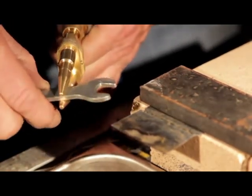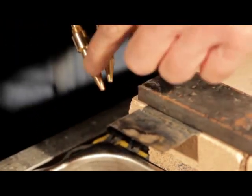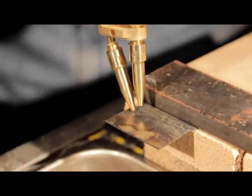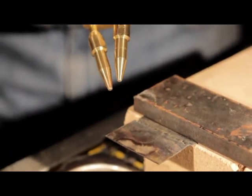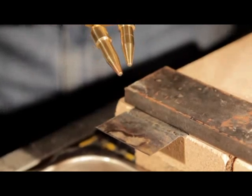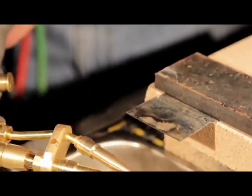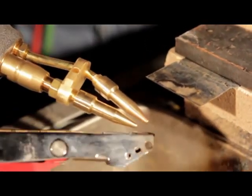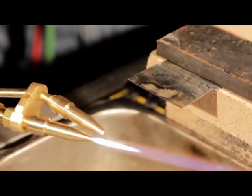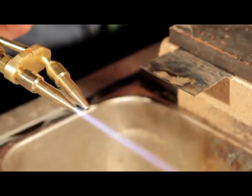You can push it in or move it out if you have to. When you cut with it, you're going to heat with the top tip. You want that back tip at roughly about a 45. It can be anywhere in that range, and you want that tip within a sixteenth of an inch, so you can take that bottom tip and drag it right on the metal — you're not generating enough heat to actually mess it up. When cutting thin metal, you don't need a real hot flame, just a neutral flame. When you pull the trigger, make sure you've got a neutral flame.